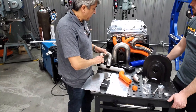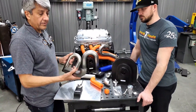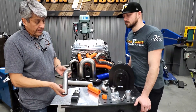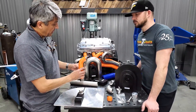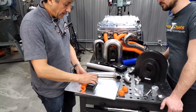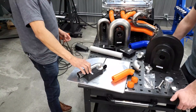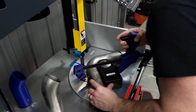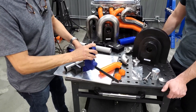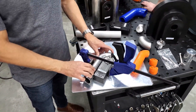This same method works for every other series. It not only works for U-bends that are full or complete, but also for partials. This is important because it allows us to maximize the use of our material. So let's say on any given project you have an extra one of these — you can still take out at least three inches off it. If one of my parts needs to be only two inches, I go back, do my adjustment, and use the actual bend. When we do this on partial U-bends, we strongly recommend using a clamp to avoid vibration or the tubing jumping. Lock it in place for a solid feel, and that lets us take advantage of leftovers from previous designs.